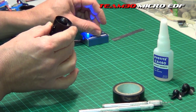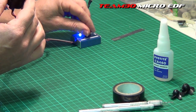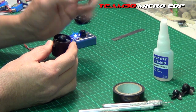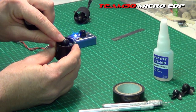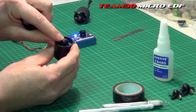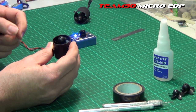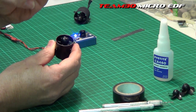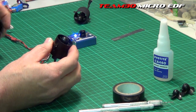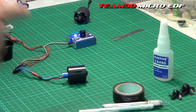That feels really good, so I'm in the right spot. The next thing I do is take your eyeglass and stare at the shaft hole — because when you rev it up, if this thing's out of balance and you can't feel it, you'll see it. That hole becomes blurry. If it stays crystal clear, you know it's spinning on its own axis — it's not wobbling. So that's the test I just did. I had a look down it and saw that it was spinning through and not vibrating — just ever so slightly. So this thing, to me, is balanced now.